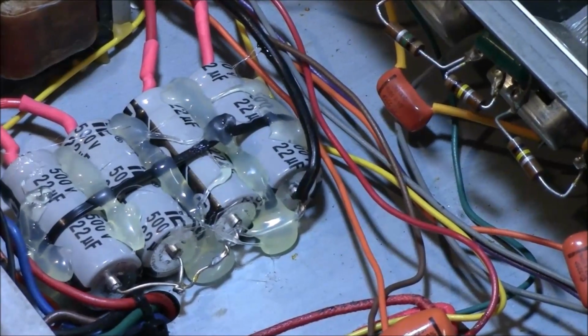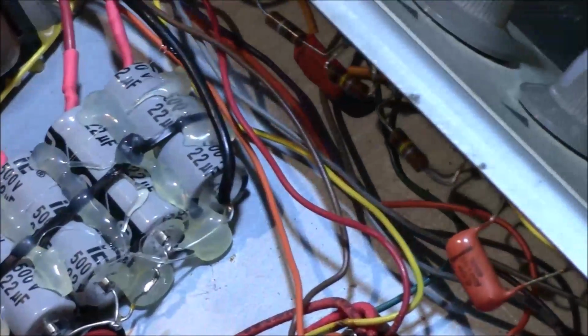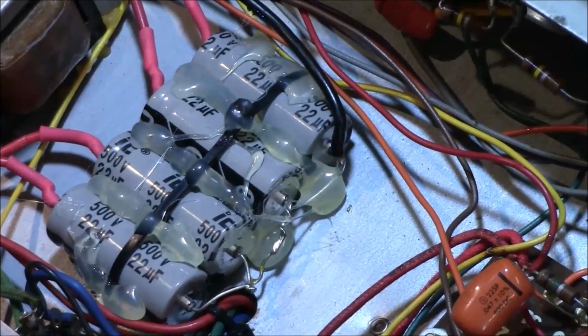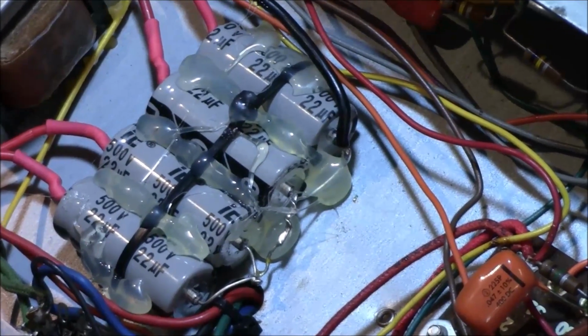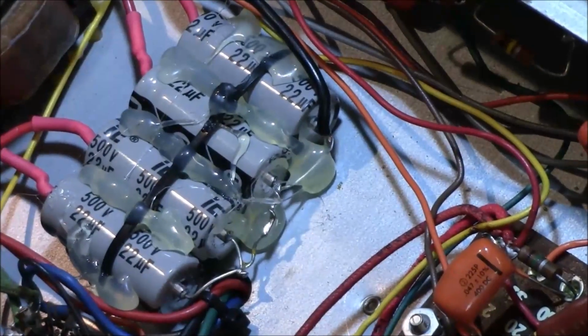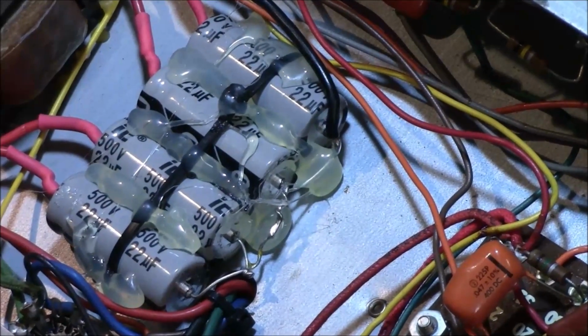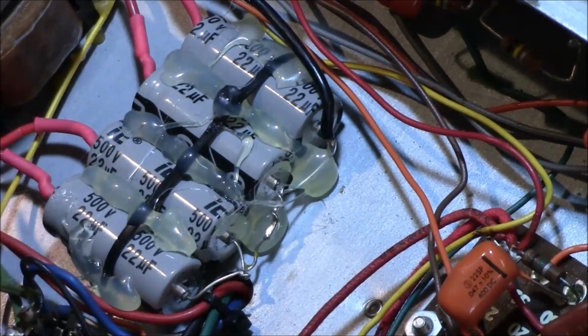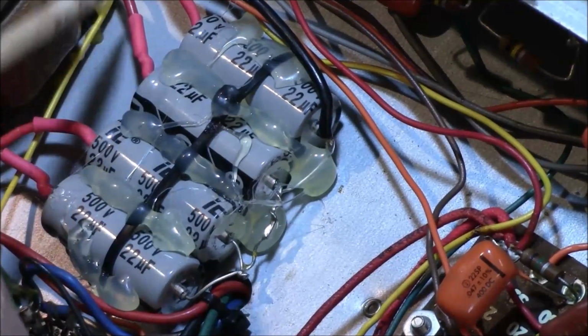So I'm going to use the same method on another amp I'm working on, an old Gibson, because that can cap, they don't make those values anywhere near it. As weird as they were, so varied. And it definitely needs to be replaced. So we're going to have 3 instead of 4 lining up here. And there's positive there, and there, and there, and there.